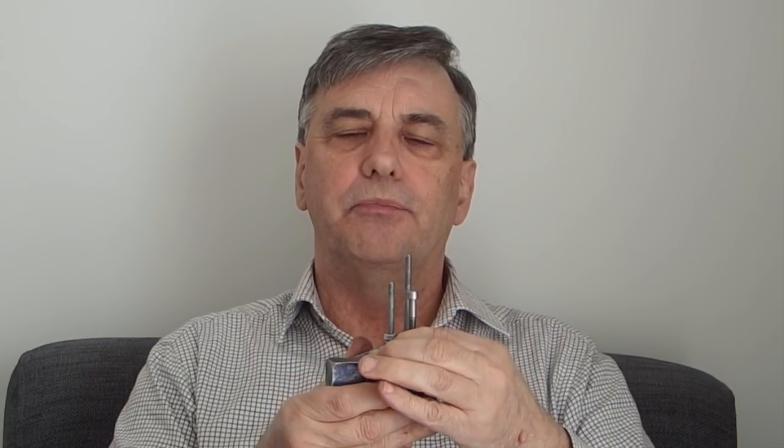Last week we made the carriage stop for a dial indicator, and you may have noticed there was an extra hole on the end that wasn't used. So this week we're making a multiple stop fixture that rotates so you can dial in whichever stop you need. This is mainly for batch work when you have a lot of parts that you want different lengths to be accurate, and we use threaded bar and six millimeter nuts to make the stops. Let's go into the workshop and see how we make it.